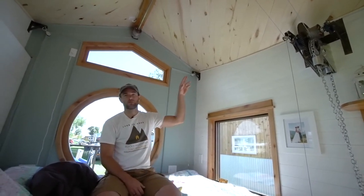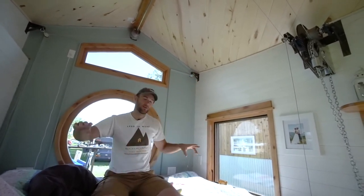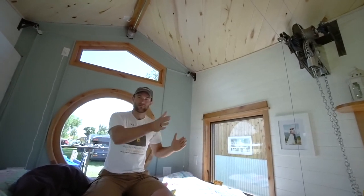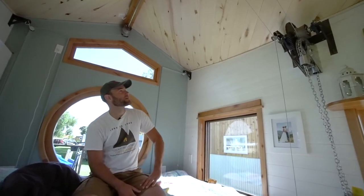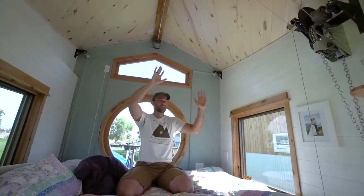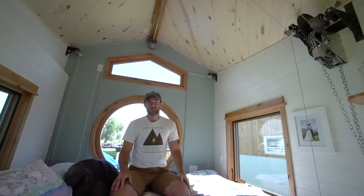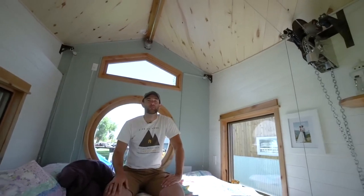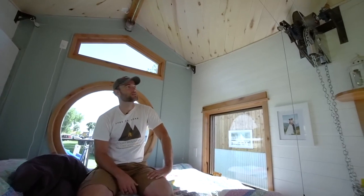We had to do the same thing for the roof decking — you can't just use a flat sheet of plywood. We had to rip it into 8-inch strips, put them at a 45, and trim all the ends off. It's a lot of cutting, a lot of time. Sometimes it's really hard to pull a tape on those measurements — you sort of just have to get it close, see if it fits, and chop it. It was painstaking, but the result is just mind-blowing. We'd done it on one other house before, so it was kind of a no-brainer.